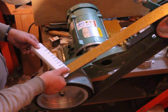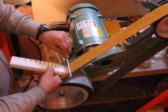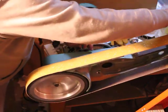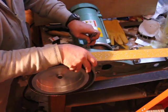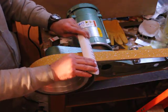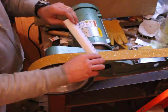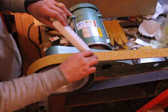You follow the perpendicular to the tangent — this tangent. Now, if I change this angle to horizontal, approximately, you follow exactly the same motion. What you're doing is going along here, and then you have to raise the knife to come up and pivot along this motion. It's not lifting the knife in some awkward way — it's not doing all kinds of contortions and poorly explained ideas. You are simply following and raising, but you're still in the same plane.